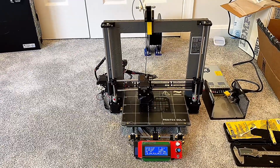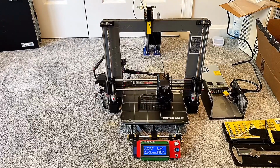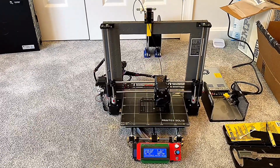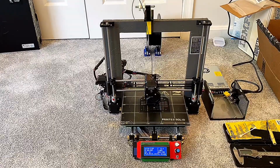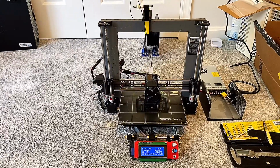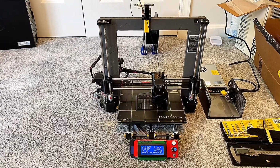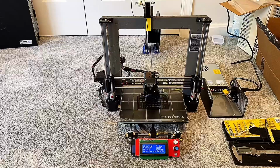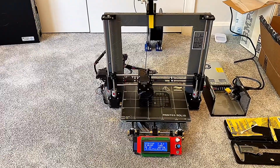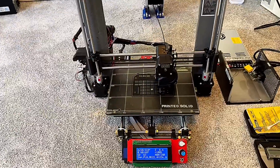There were some instances where Prusa calls for 18 millimeter in length, and while Fastenal does list those as part numbers, they just weren't available. And so I had to get 20, and with my Dremel, shorten a bunch of screws, and that was a pain, but you can do it, right? And yeah, I think it came out pretty nice, to be honest with you.